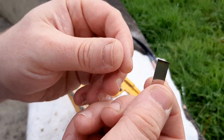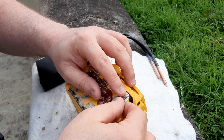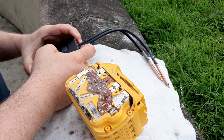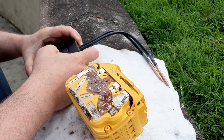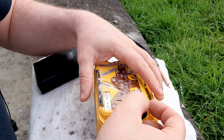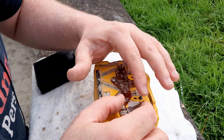I've got a little bit of nickel strip cut to the right size. I'm going to tack it on there nice and neatly with my spot welder. The spot welder's turned up nice and high. I'm going to tack it on and get it to stick nicely — that's maybe better there.